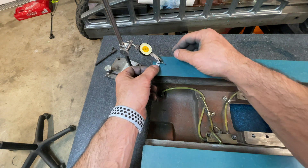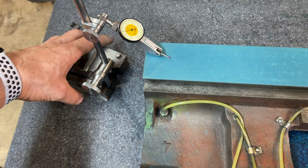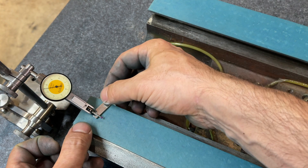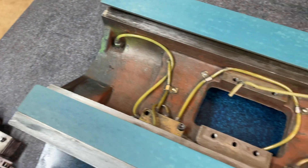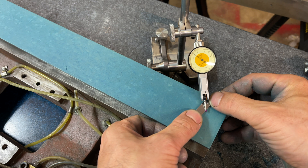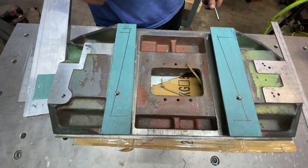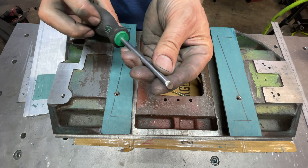I'm going to zero it down right here. Moving over — that's one tenth. And here — one tenth. And zero. That is it — I'm going to call that pretty much perfect. And this Z-pattern I'm going to cut for an oil groove, using this old screwdriver I ground to a 45-degree sharp edge to cut the Turcite.